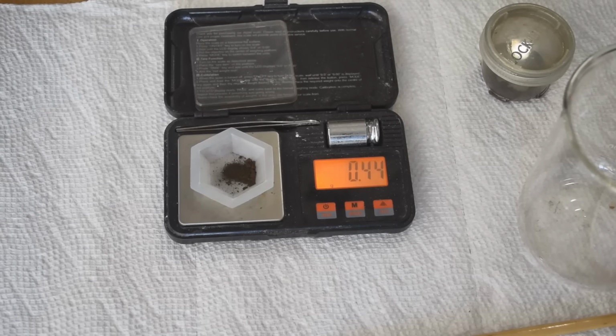And Stan, I gotta thank you again because a lot of those chips came from you. Not all of them, but a lot of them came from you. So thanks again for sending those in. That's a fair amount of gold for that small amount of chips. And, you know, I have several different ways to process ceramic chips. I have another video out there where I use my other ore crusher. But it doesn't crush them up as fine, and it doesn't separate out the steel legs as well. So I think I like the Mighty Mill better. I think this process worked pretty well in spite of all the issues we had with lead. I think it worked out pretty well.